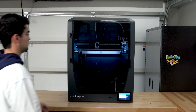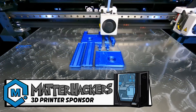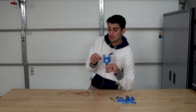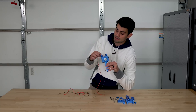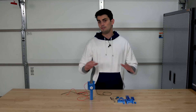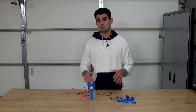I first printed this model out of Matterhackers' Silk Blue PLA just so that I could keep the door open on the BCN3D Epsilon for filming purposes. But this is not the best choice of filament because as you're soldering, the insulation of the wires will heat up quite high, which can cause the clamps to melt. You're going to want to use a more heat-resistant filament like ABS or polycarbonate. Of all the models I'll cover in this video, the solder helper requires the most assembly.